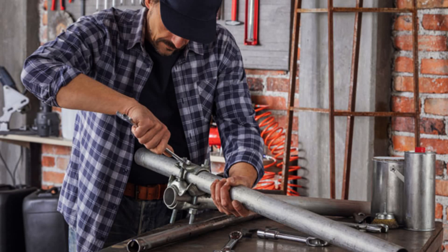Step 4: Start brazing. First, heat the base metals and raise their temperature evenly and fast. Use a gas air torch or anything with a soft flame and start heating the tube only a couple of inches away from the fitting. Sweep the flame back and forth from the tube to fitting, as this will ensure that the filler metal will wet properly and fill the joint. Just as the metals reach a dull red color, pull back the flame and add in the filler metal. You will notice the filler metal melting, penetrating, and spreading across the joint right away. Step 5: Clean off the excess. If you require some post-brazing cleaning, just wash it under hot water and scrub the areas with a soft brush.